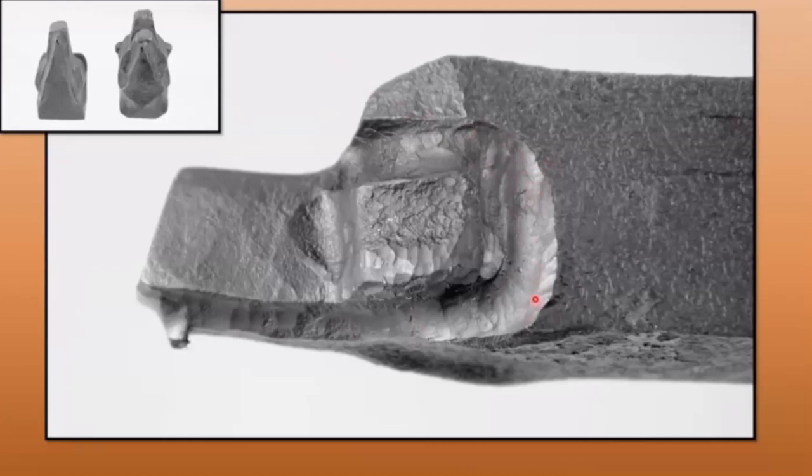So the first thing you're going to do is just create the channel by coming square to the stock as you see it. So as you come along again on that 45 degrees, I want you to hold it perpendicular to the 45 degrees. And then you'll notice as I come around the corners, I am trying to leave some hatch marks there from the fuller. Again, I'm just trying to denote a little bit of feathering or the fur.